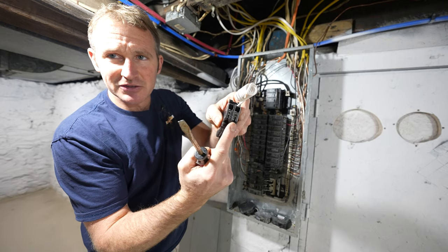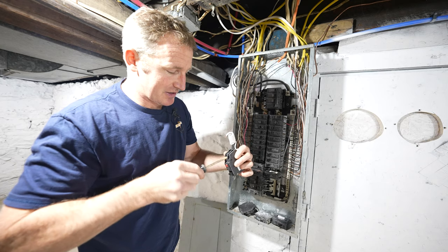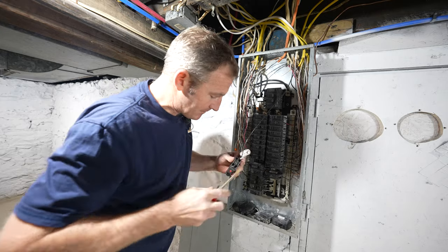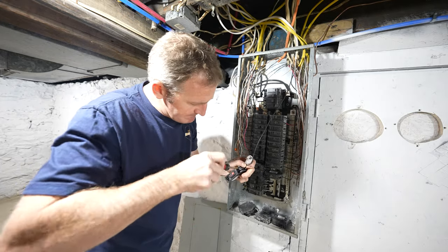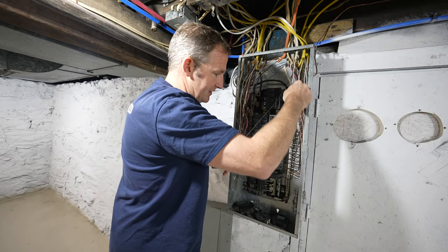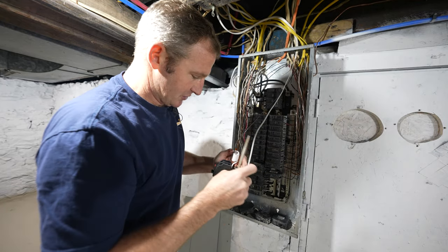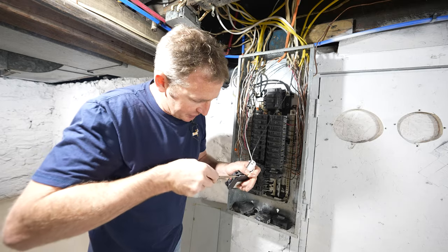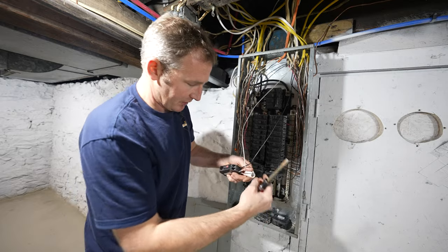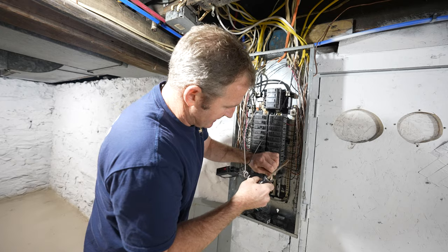You basically just take out the existing breaker for that location. There are two wires here: one is going to be your neutral and one is going to bring your power. We're going to connect our power first since I already have it disconnected. Always toggle on these things to make sure they're safely installed. Then we're going to take our neutral line out of the bus and insert it into the neutral side of this breaker. Then we're going to take this little pigtail wire and stick that into the neutral bus.